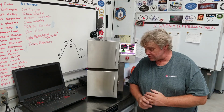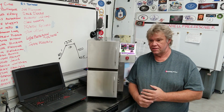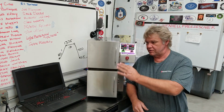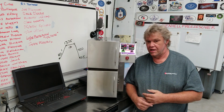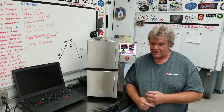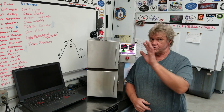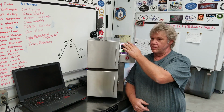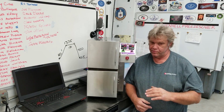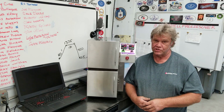And I've done some extensive testing on this. We put it through its paces at 2000 degrees Fahrenheit on the lower oven, 600 degrees Fahrenheit on the upper oven, and we ran it for 72 hours with no ill results. Next up, I did a torture test. I went to 120%, which is not recommended to you guys, but I went to 120% on both controllers and ran both ovens over temperature for 24 hours. If it was going to melt down, that's when it was going to do it.